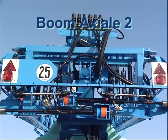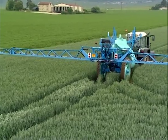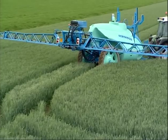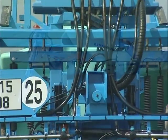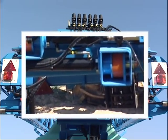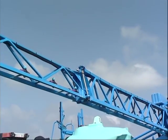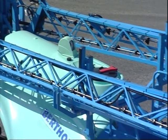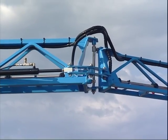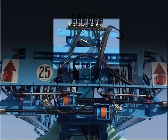Available with working widths from 24 to 33 metres, the Axial Boom has already proved its high quality over the last years. The suspension on the central pivot ensures exceptional vertical stability, especially on turns and hillsides. The Axial 2 independent shock absorbers, one on each arm, avoid whipping when increasing speed or braking, protecting the boom's structure. Rigidity of the triangulated structure. Sturdy points of articulation coupled with long service life for the hydraulic rams, as the pistons are retracted when the boom is in the working position.